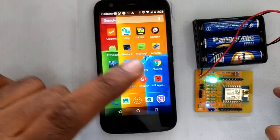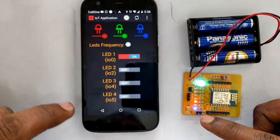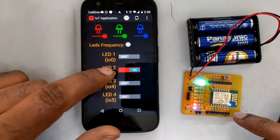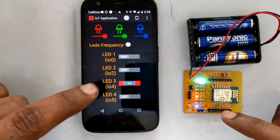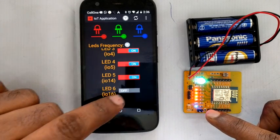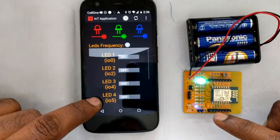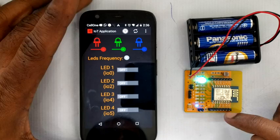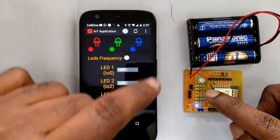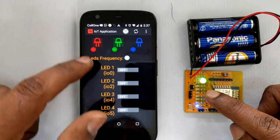Now open the app and then touch on LED 1. The LED connected to GPIO 0 will glow. Now touch on LED 2, which will switch on GPIO 2 LED — this is also connected to the LED on the ESP board. You can now test the operation of other LEDs by touching LED 3, 4, 5, and 6. The RGB LED can be controlled using the three sliders seen on the top of the app. You can use the slider to make it more red, more green, or more blue. It seems the red and green icons are interchanged in the app. You can also test the LED frequency slider.